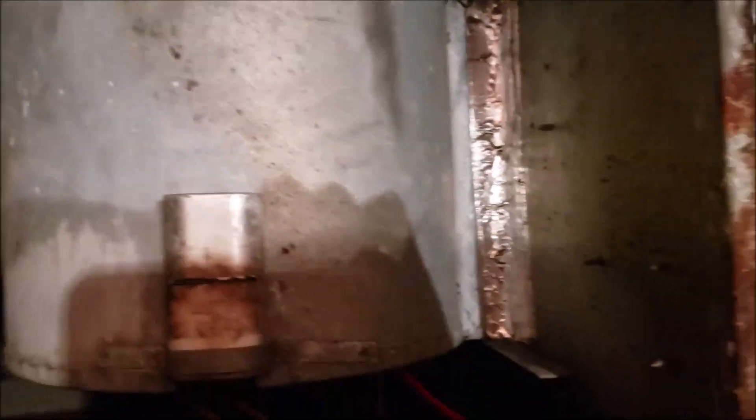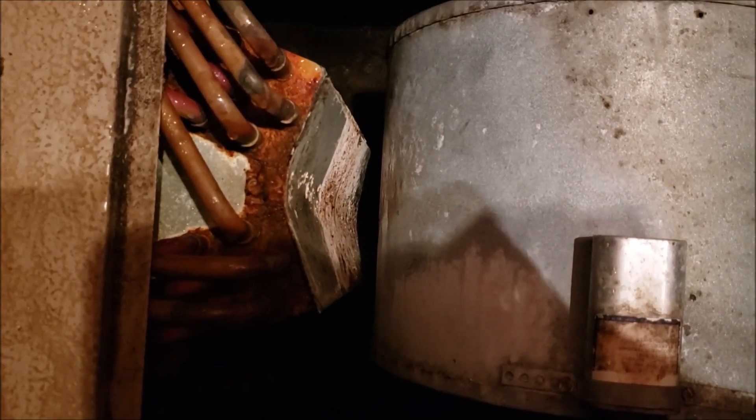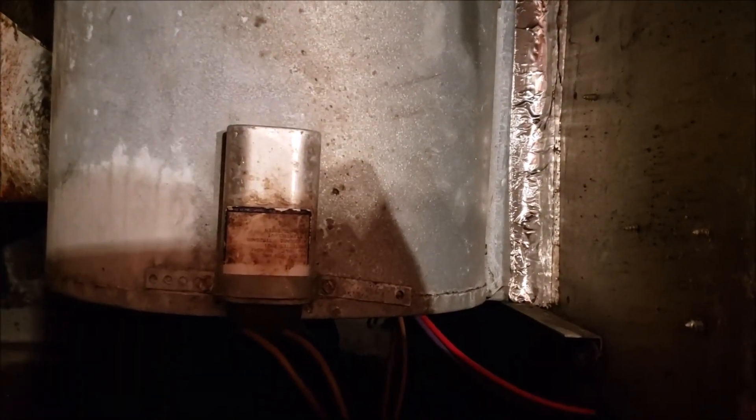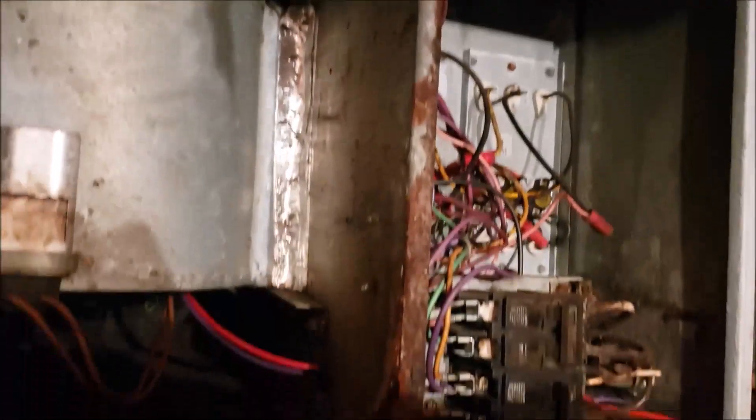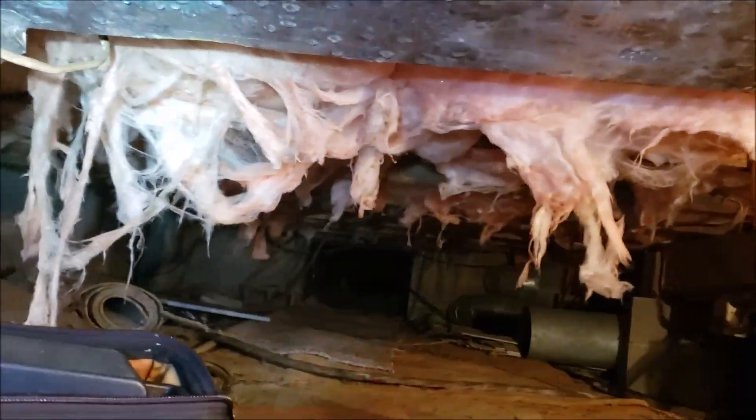Something's happening — I hear the Freon pumping through the lines. Waiting for the sequencer to warm up. Should engage shortly. There it went — and it ain't making that noise we had a couple of hours ago. Alright, so now I just got to put this panel back on there and go inside and enjoy some nice cool air. Got everything all put back together — now we'll head back into the house and make sure everything is cooling properly. Pick up my little toolbox and get the heck out from under here with all these bugs and spiders and creepy crawlies.